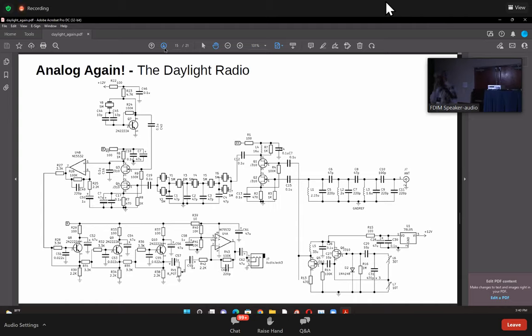But it really changes your entire experience of using the receiver, and this is what I did with a lot of people. You strap on your headphones and keep listening to this. So you say, how is it? It's very nice. And then I say, okay, I'm switching it off. So I switch off the audio filter, and then he says, no, can you just put that back immediately? Because suddenly there is all this noise above 3 kilohertz streaming into you that you did not know happens on simple radios.